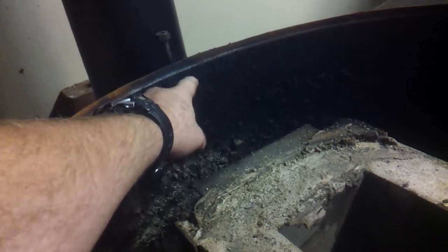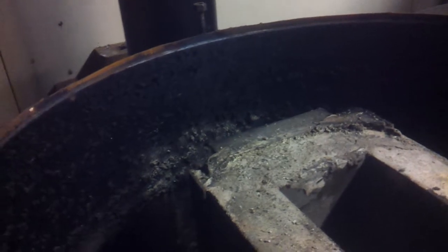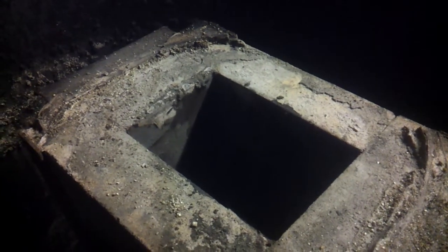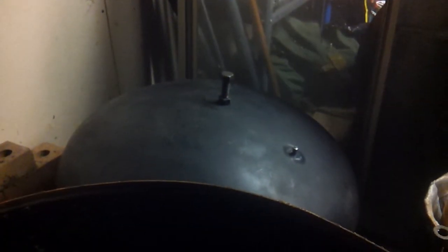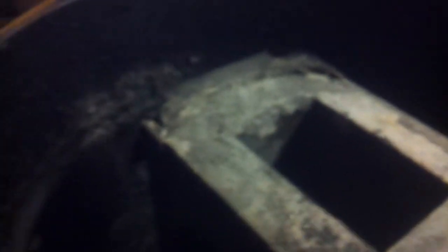Some of the creosote was dry and crisp, but other areas were a little tacky — we obviously don't want that, as it could cause a fire. The other thing is I was burning straight pine in Virginia because that's what was readily available. Stack temperatures never really got too hot; the hottest I ever read at the top of the heater was about 350 degrees, and right at the exit it usually ran around 130 degrees. We need to get that up to 250–300 degrees.